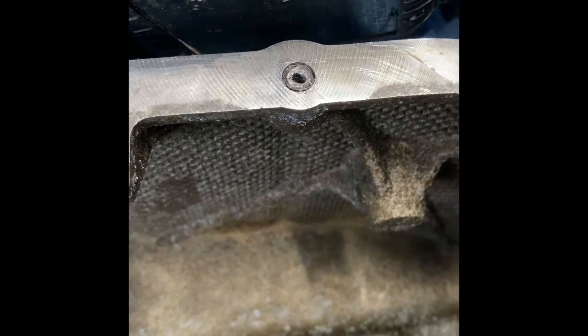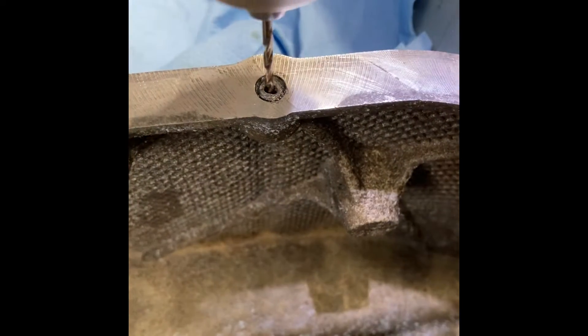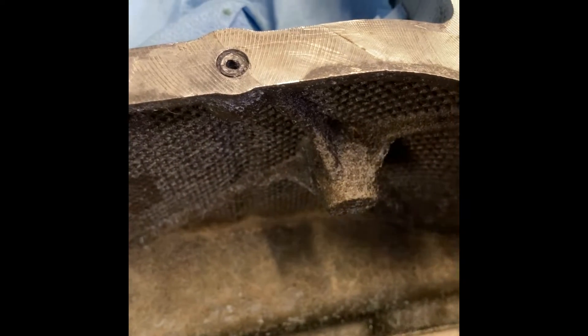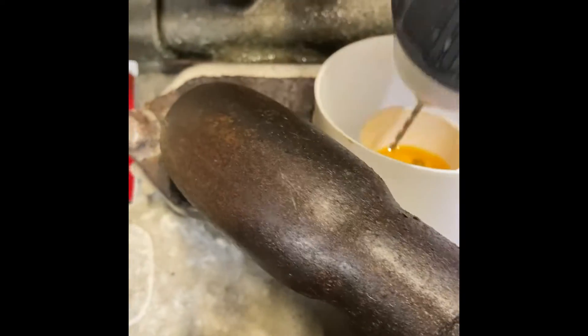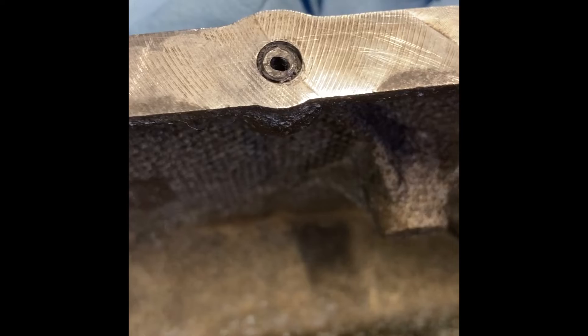Not a great video to watch me drilling slowly, but I started out with a little 1/16 inch bit, able to penetrate clear through to the other side. Some of these are blind holes — they don't have an opening on the other side, so you do not want to drill through. Basically I'm taking the smallest sharp bit I have and using some lubricant — in this case PB Blaster — to keep the bit cool and lubricated and keep the flutes clean as you're drilling.